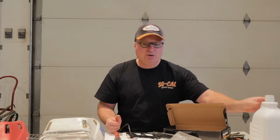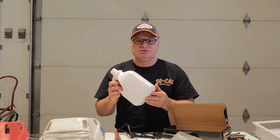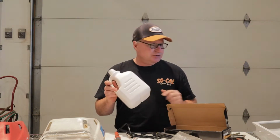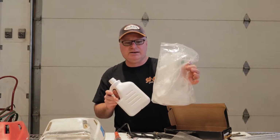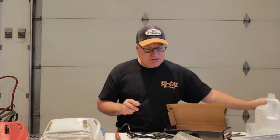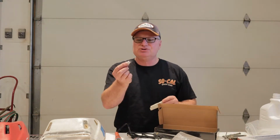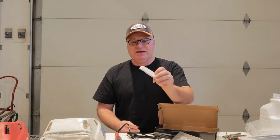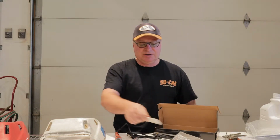But for the most part, for filler rod, we're going to use a milk jug. It's made out of HDPE, and it's a very universal type of material, and all you would do is just cut it into strips. What I usually do is I have a bag of them all ready to go, and this seems to work well for many applications. Many times when you're doing a repair, you can also cut little pieces off in discrete areas. This is some parts from the ATV that I spliced some pieces together, and these were leftovers. So this is great filler rod too, if you can grab some from the parent material, that works well. So follow along, and we'll get started.